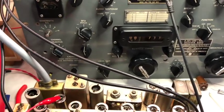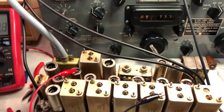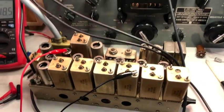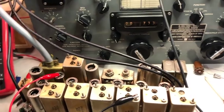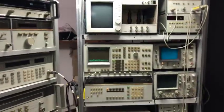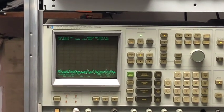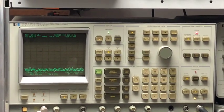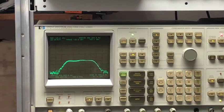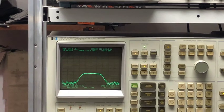Checking the components doesn't give me any clue where I can find something wrong, damaged, or faulty. So I decided to perform a different way of adjustment using my spectrum analyzer, and it seems that was the right decision. Indeed, if I raise up my RF gain, I'm now having a nice shape — this is 16 kilocycle, this is eight kilocycle, this is four kilocycle.